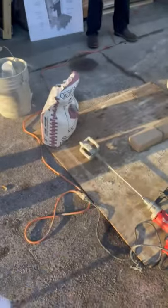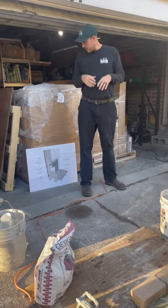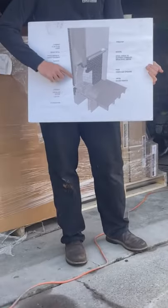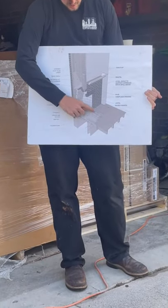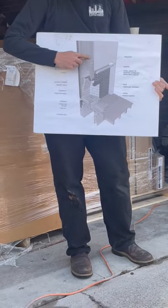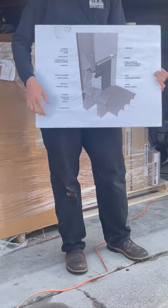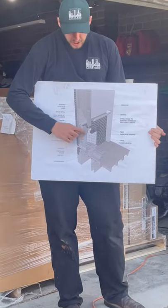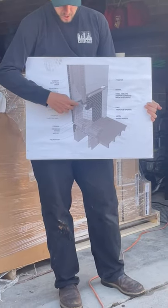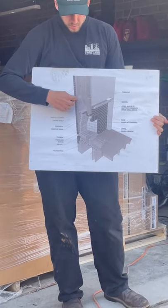A chimney lining component is a high heat rated material that is designed to funnel and contain heat through the fireplace structure. The structure being the exterior wall, the interior hearth, or the structural wall of the fireplace facing. The breast right here, all these structural walls, we don't want them to be exposed to any heat. So the chimney lining in the firebox is refractory fire clay. There's refractory cement, fire clay mortar, and refractory cement hard coated to the interior of the smoke chamber.